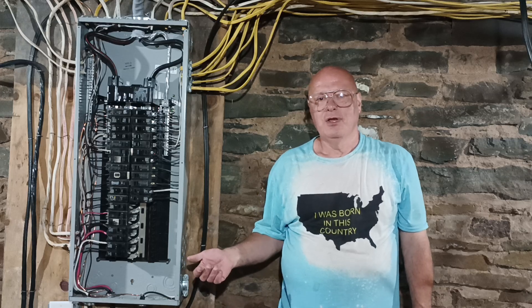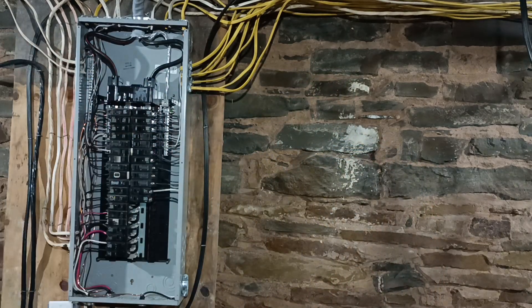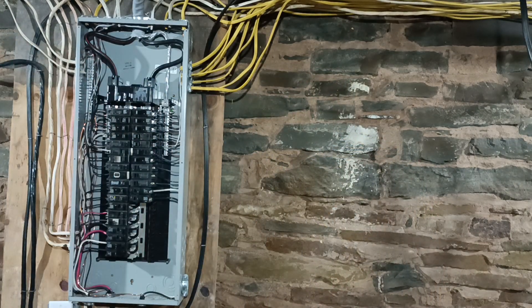So here in this country we use 14 American wire gauge on 15 amps, 12 American wire gauge on 20 amps, 10 American wire gauge on 30 amps, 8 American wire gauge on 40 amps. Black is live, white is neutral, bare or green is the ground. Red and blue are also live colors. However, you may find white live in a switch loop or a 220-240 volt circuit such as this one — these two we just installed. The white is live. Dave, do me a favor, grab that extra red wire cap and put it on.